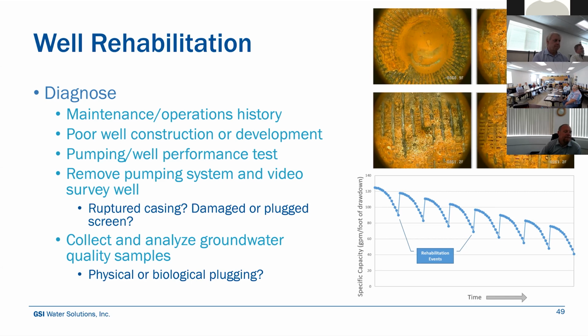You're referring to driller's mud, correct? Yes, driller's mud. Yep, that's right. And oftentimes they'll use mud for hydrostatic pressure to float the cuttings up and keep the walls open, as opposed to drilling and driving casing, because that can be time consuming and expensive.